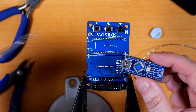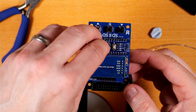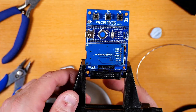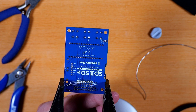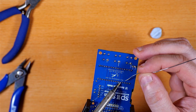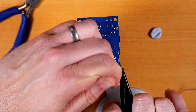Now we add our Arduino Nano 328P board. Pay attention to the USB connector location and the PCB orientation marking. This one already had the header soldered on, so I just had to finagle those through the holes — it was a pretty tight fit, so I didn't need anything extra to hold it when I flipped it over and soldered all those pins. With the soldering complete, I sprayed with a little alcohol and scrubbed it down with a swab.